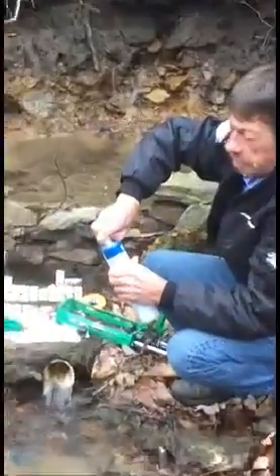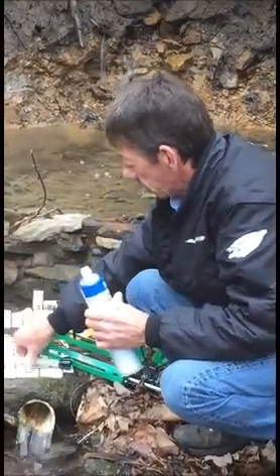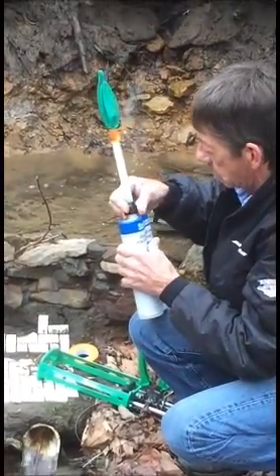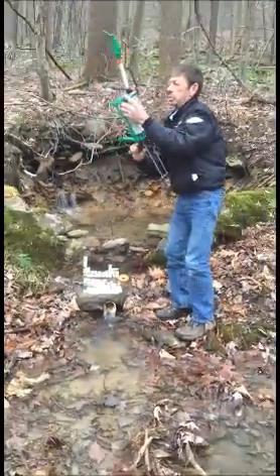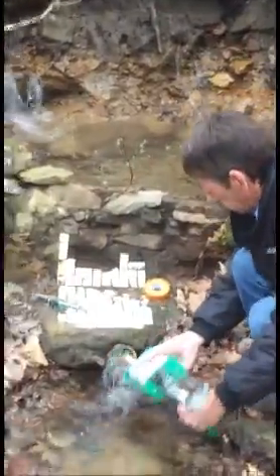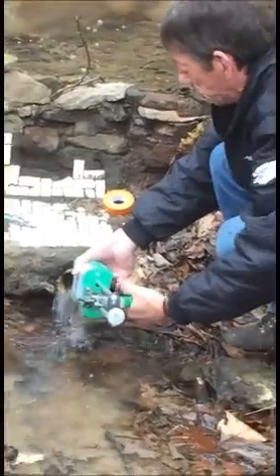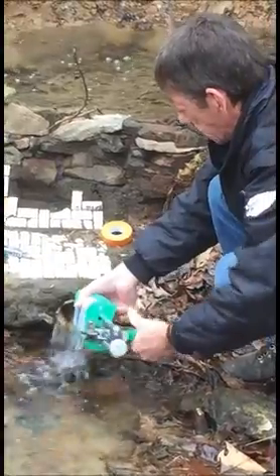Remove the cap. You can save this cap and recap if needed for reuse. Put the mixer on it. Load it into the dual component caulking gun. Insert it into the pipe and start pumping. Pump very fast so it can fill up the balloon as quickly as possible.